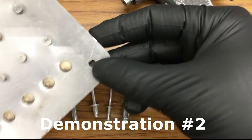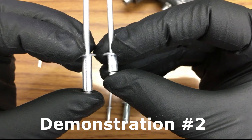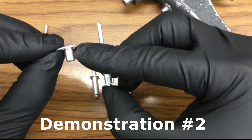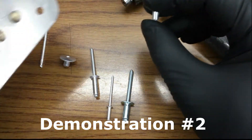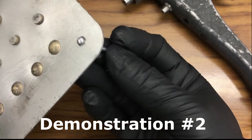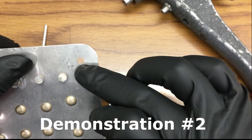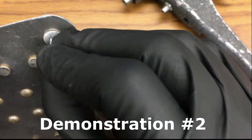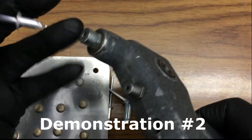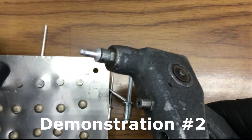Now let's do this on a piece of scrap metal. You have to consider what length you need. If you're just doing two pieces of sheet metal, this is a little overkill — you want the smallest length possible so you don't have to work so hard just to get this to break. So over here I have a hole pre-drilled. With the handle open, I fit the rivet in here first.